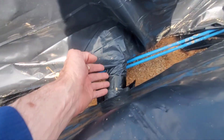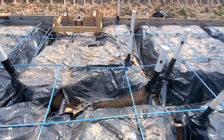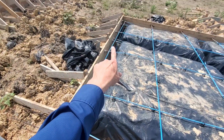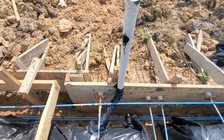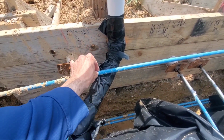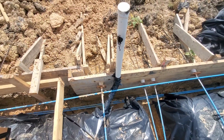Again, coming through here, you can see that these tendons are just about on the ground. You can see that over here, this tendon does not have enough clearance. Right here, it's just about in contact. There's a little bit of gap there, but you gotta have clearance between the tendon and the pipe, especially in a place like this, because when this tendon is jacked, they'll put 33,000 pounds on this thing, and you can see how it has a bend up like that. Well, that is gonna wanna push it down. It's gonna put pressure on this pipe, and it's already making contact. So there needs to be a space put in right there.